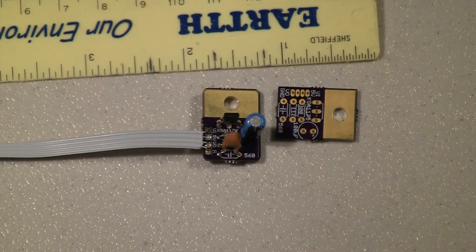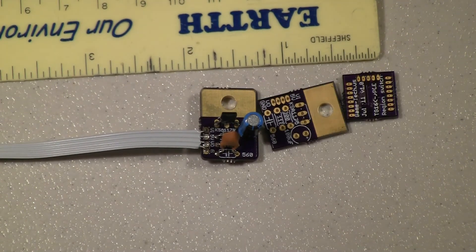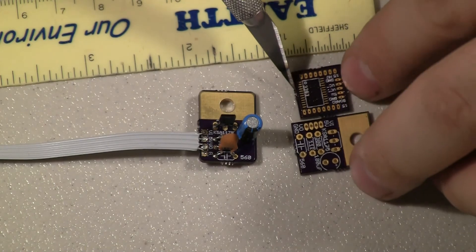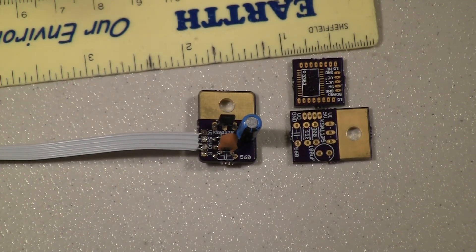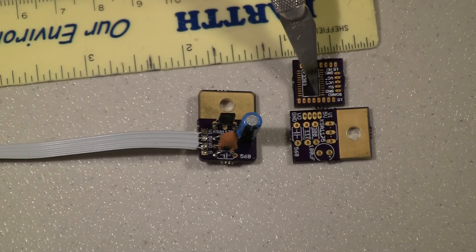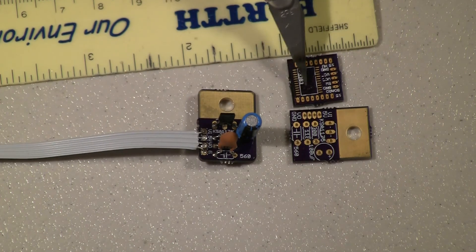I had done a smaller board for a TG16 region mod. All the way around the outside are the original ribbon cable connectors I tried to have fabricated — about 0.25 diameter pads with maybe a 0.22 or 0.23 diameter hole. It just didn't work. There's plenty of solder mask between the annular rings but the actual holes are so tiny you couldn't even fit 40-gauge wire in there. They just filled in somehow.